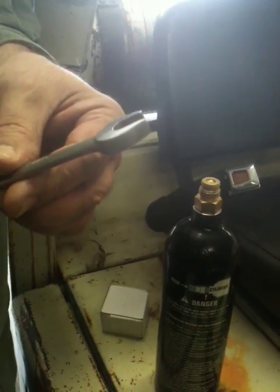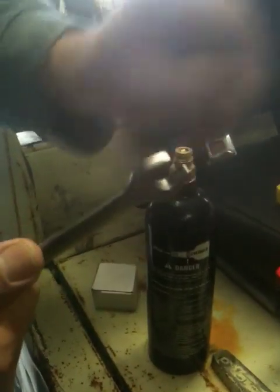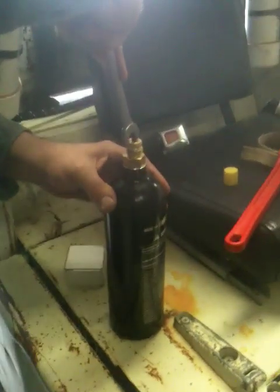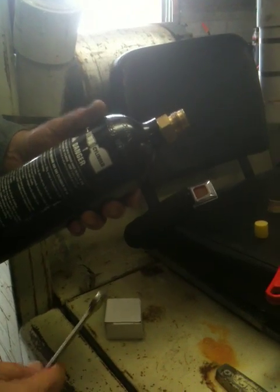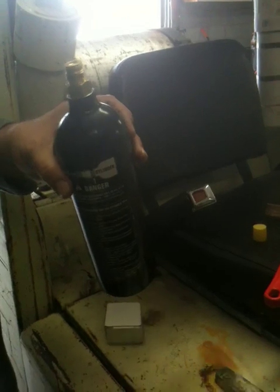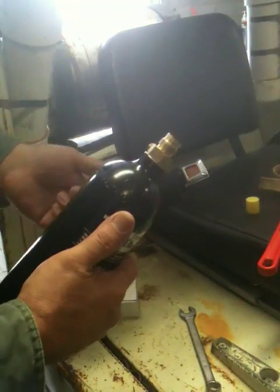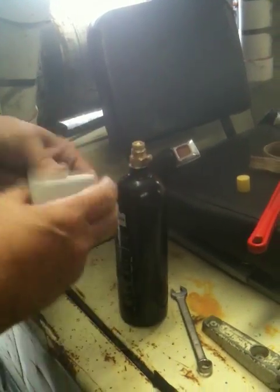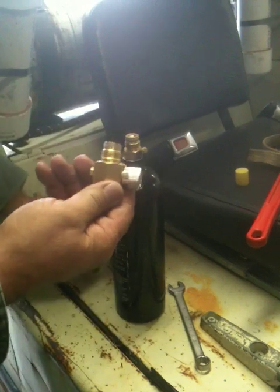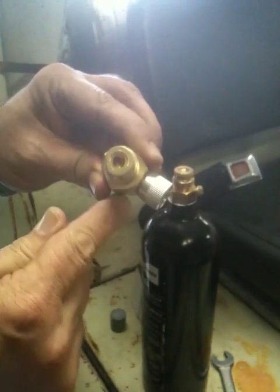The gas boils in the tank at about 100 degrees below zero Fahrenheit, so it gets very, very cold. You want to make sure that you bleed your tank completely. You can't rush over with a wrench and go taking this off — that is not possible. These tanks are built so that the valves go in extremely tightly to keep your average person from opening this thing while there's pressure in the tank, sending it flying like a bullet and blowing a hole in someone. So if you've got a pin valve and you want to replace it with a nice on-off valve — an on-off valve allows you to turn the gas on and turn the gas off. It does not have a pin.